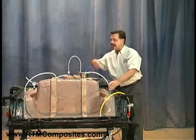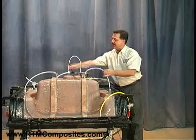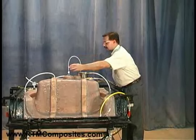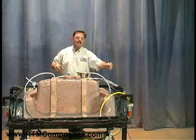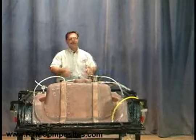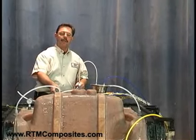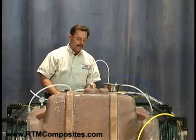The last connections — in this case, two injection ports. We've got more than we really need, but two for demonstration purposes. We'll tee the mix head in here and the resin will flow to both sides, circumventing the cavity and converging to this point. So we have very simple connections: a regulated line, an unregulated vacuum line, and the injection line. No other wires, sensors, or things plugged into the mold — we make it as simple as possible.